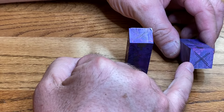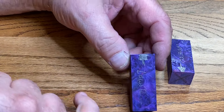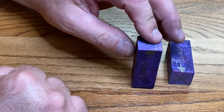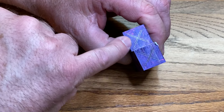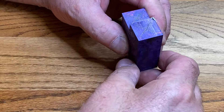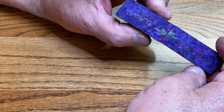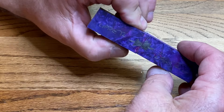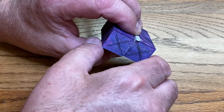I found and marked the center of both of my blanks. Notice where I marked the end of the blank where the arrow points — here's the lower blank, there's the arrow, and there's my mark. The reason why you do this: we marked our blank where we cut it, and we marked the centers of the blank. We'll start at dead center and drill through the blank. If our bit gets off at the other end, we're still guaranteed to get a nice match because we start at both holes at dead center. This is just a little trick that helps you match your blanks much nicer between the cap and the body.